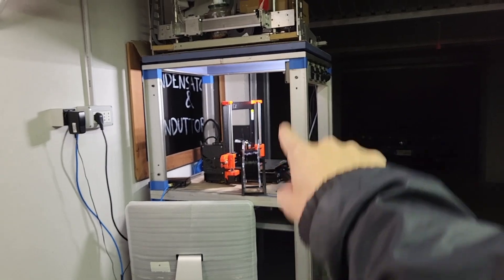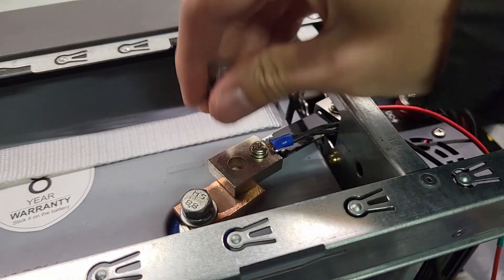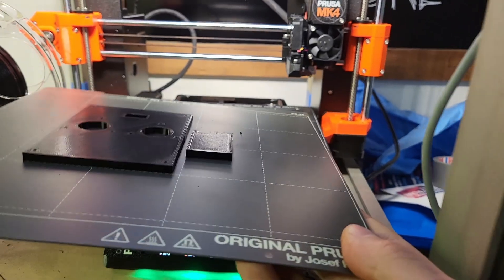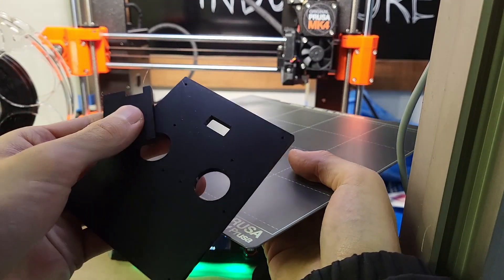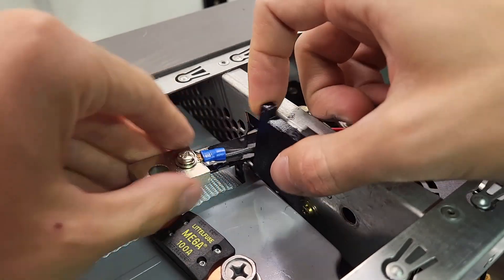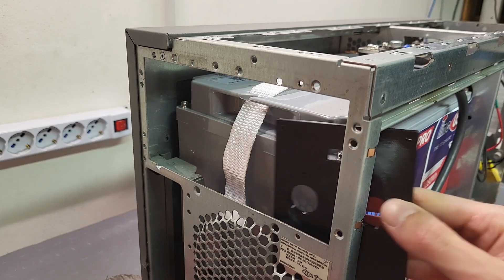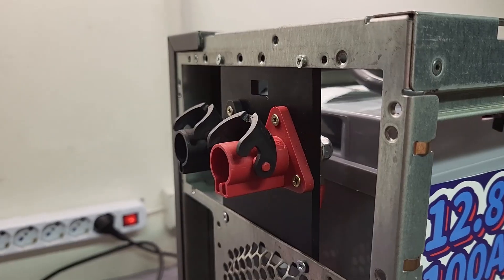My new Prusa MK4 is printing at full speed. While the printer works, I disassemble the copper busbar I made. The print completes — I wasn't expecting this little printer to be so fast and precise. It's a PEI-coated magnetic bed so the parts stick really well, and I just flex it and they pop off. I reinstall everything including the fuse connected to the battery and the shunt holder. I also install a second fuse for the external batteries. The full project schematic will be at the end of the video. With another 3D printed part I create a mount for the two massive 200 amp external connectors, then prepare the necessary power cables.